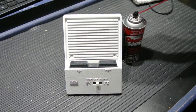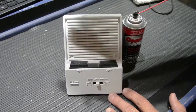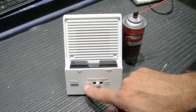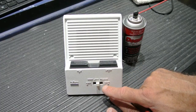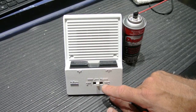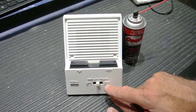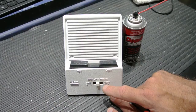An apartment house speaker is a simple speaker. You have only three controls. You have a push to talk button, a push to listen button, and a door release button. The door release button can activate either door number 1 or door number 2. On some 478 apartment house systems, the control amplifier will choose which door to unlock based on where the visitor pushed the button at the entry panel. So it doesn't matter in those systems which way you move the door lock release switch, it will unlock the appropriate door where the visitor is.